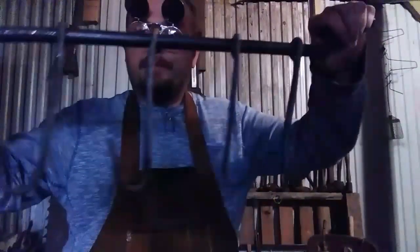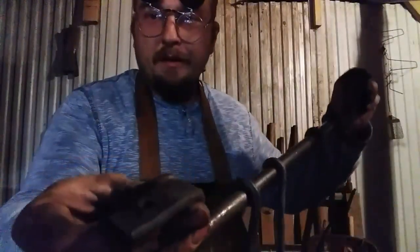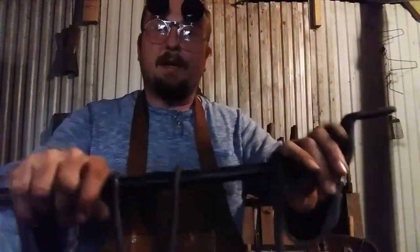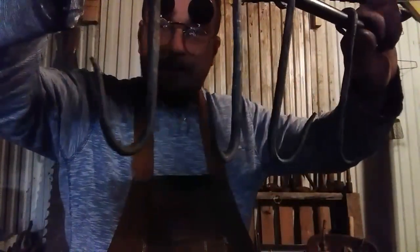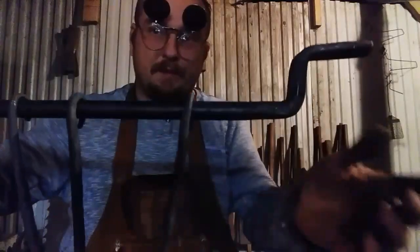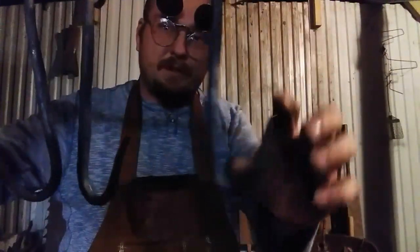Well, here it is. Here's the pot rack the missus requested. Got little holes. These will move around. I'm going to put some big fender washers inside the cabinet I'm hanging it under and prevent it from pulling through. Anyway, I think she can hang them four cast iron skillets on this pretty good. They just needed to function. These are, as you have seen, pieces of this 5/8 round that have been drawn out. These started as 3 inches of material.